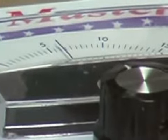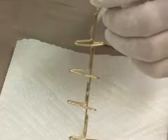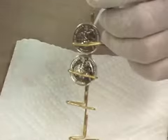Before the plating begins, the parts are polished if necessary and washed with warm soapy water to remove any polishing or foreign debris. The parts are then set in the rack. The racks that hold the parts are normally made of copper specifically shaped for the parts being plated.